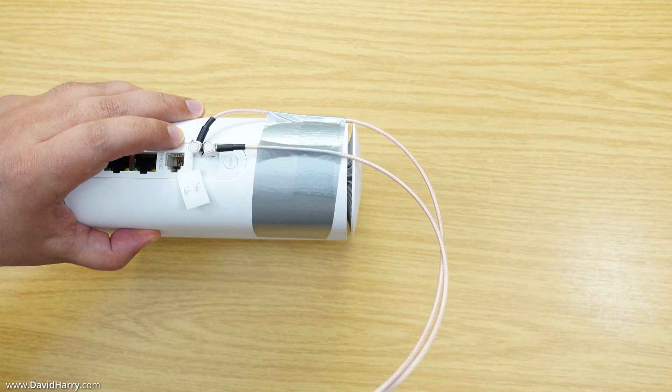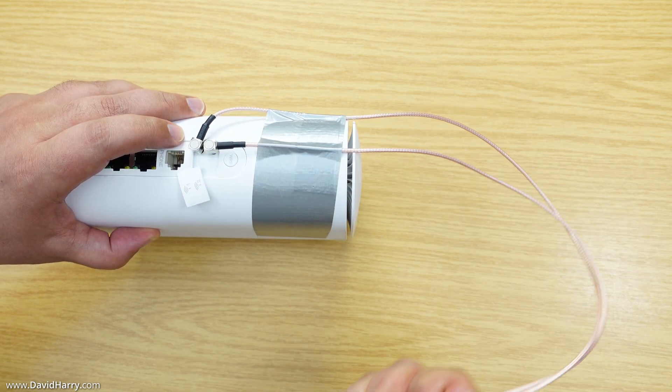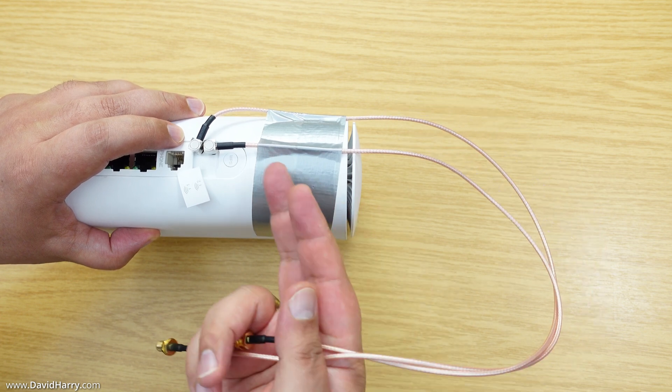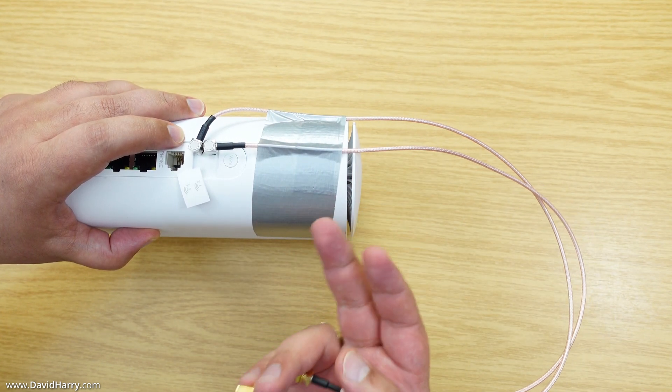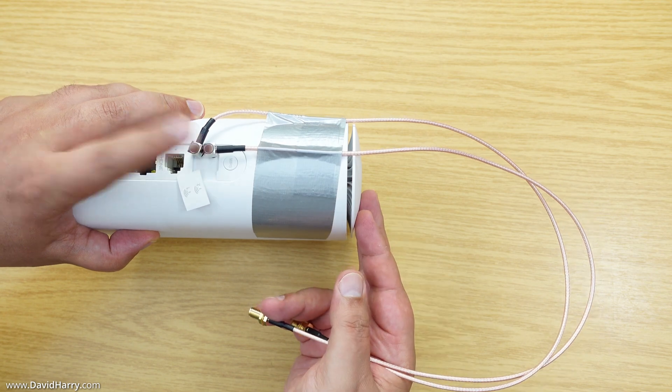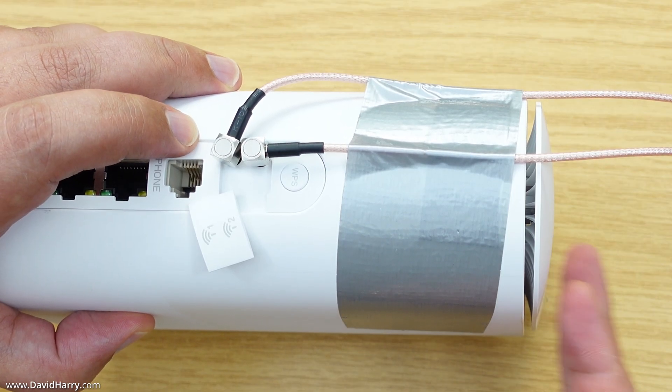I'm kind of yanking them a little bit here — of course you can't just go ripping them out, that would definitely damage it. But in light use, as long as you're being sensible with what you're plugging onto the end and the kind of movement you're doing, this should definitely give it enough strain relief so the sockets don't take all the strain directly. This is what it will look like at the end of the day — you might think it looks a bit of a mess, and I'll agree with you. But I'd rather have something look a little bit weird and protect those TS9 ports in the process.